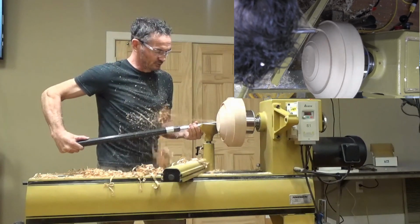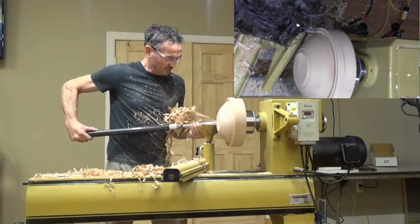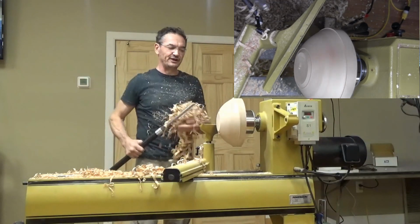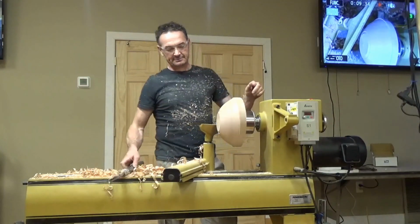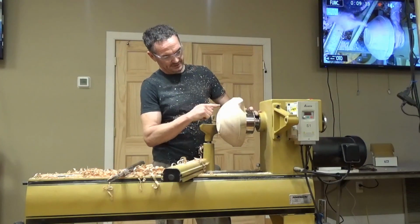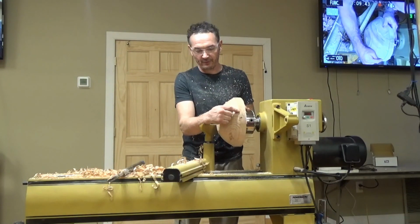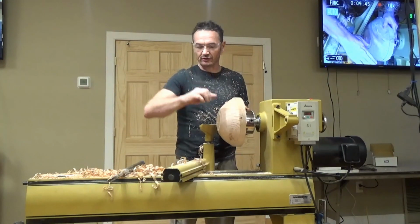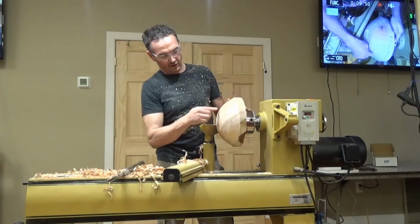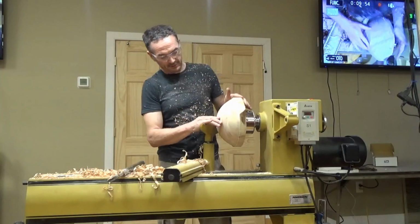So then a good volume, keep the handle fairly flat. Now, see what the finish is like before I sharpen the tool. Is it torn or isn't it torn? Oh, it's not torn. Even though the tool's starting to dull, it's not torn. Now you see the torn grain here, where I wasn't being nice to it. And now by closing the flute, and I was still taking a pretty hefty chunk, the torn grain's gone. And we know it's punky wood. We can see it's quite punky here. It's got a little bit of rot in it. But it can still be cut clean.